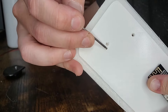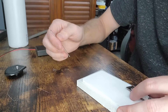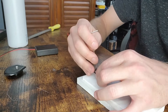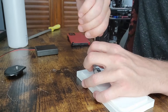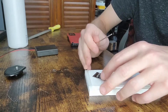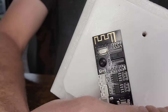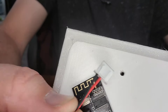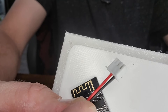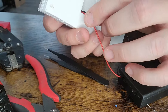So, kinda like the other standoffs, this one also broke off. The other times I've printed it, it's been fine, I promise — just this time it's been a little rough. But that's okay, it's still deep enough so we can just put the screw in here. Ta-da! Nothing to it. I actually forgot that the connector isn't going to fit through that hole — I guess I had to test the board anyway. I'm going to have to take the crimps out and hopefully they'll fit through individually. They didn't, so now I have to re-crimp these wires.